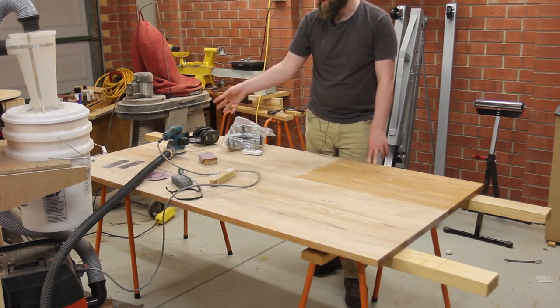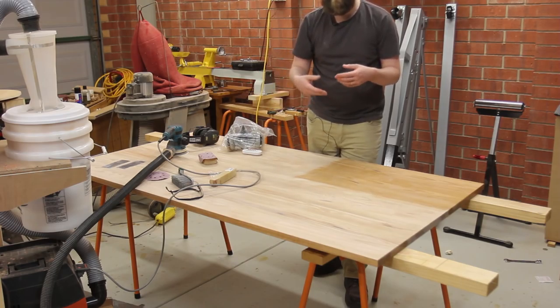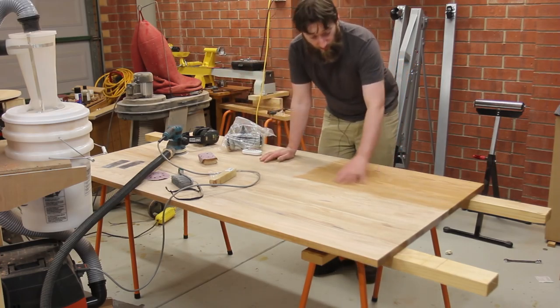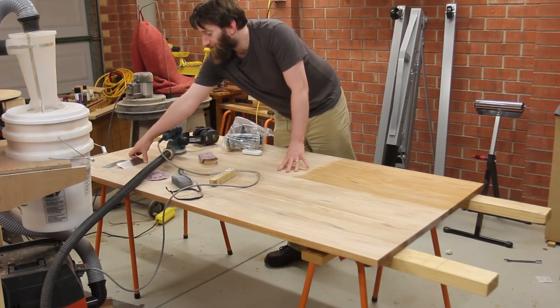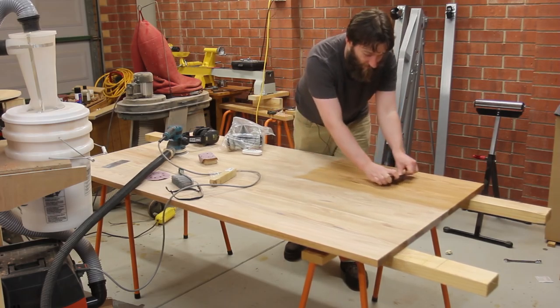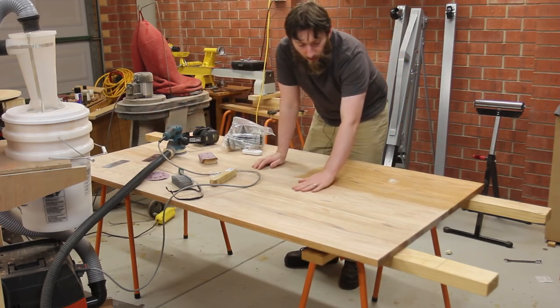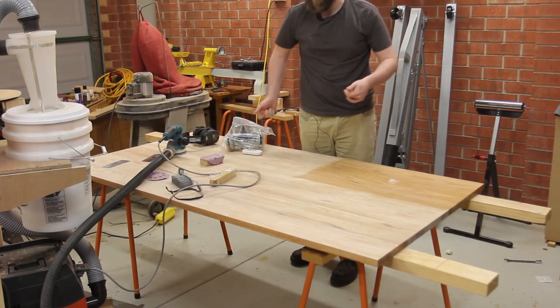I'd also recommend having a vacuum hooked up to your sander, or those little dust bags that you can get for them. That's more good intentions than anything because there's no vacuum there — it's just whatever happens to flow in there will get caught, everything else will just blow around. This, believe it or not, has been scraped; compared to the raw timber it doesn't quite look it. I can still get some more off but it's becoming slower and slower, so I'm going to give sanding a shot. The idea is we'll get down to the raw timber ideally, but that may need to be finished off with some hand sanding.